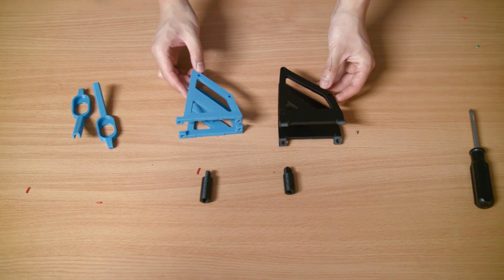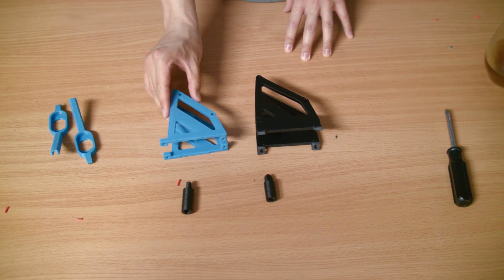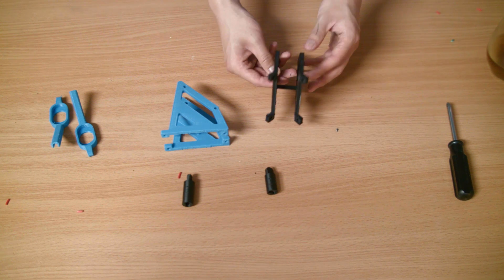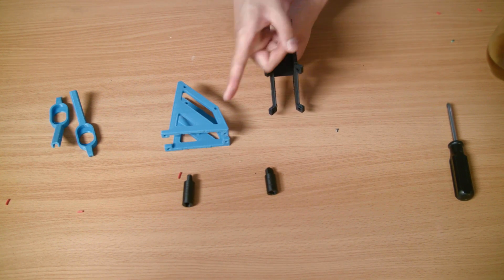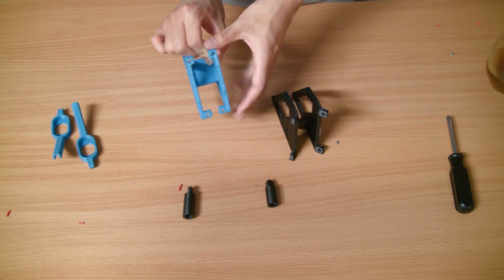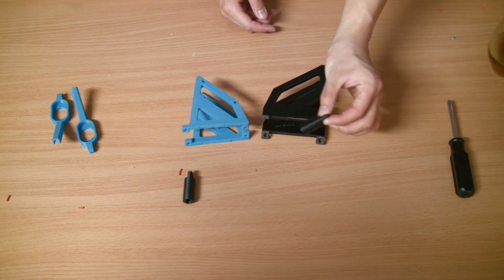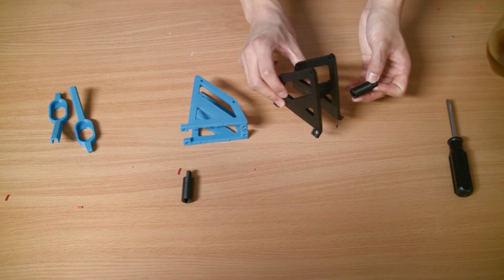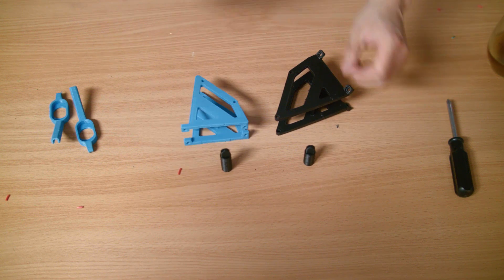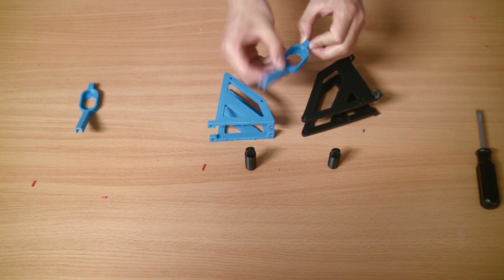Because our post only had four sides but we have six dispensers, we had to create a new bracket for the corners. The smaller ones mount on the sides, but we created this bulkier corner bracket that's a bit larger. The mounting holes on the corner bracket are at a 45 degree angle so it can mount on the corner of a post, whereas the side bracket's holes are flat and mount flush with the sides. We also printed some more extensions for the actuators, since those extend out from the corners a bit more and will be closer to the dispenser. We also have two more nozzle collars that the actuator arms actuate.